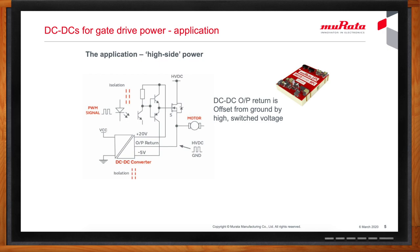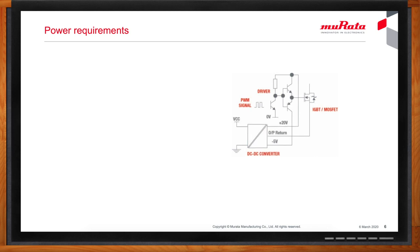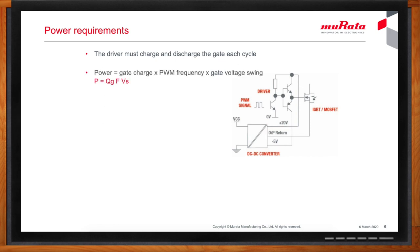Typical values seen are 380 volts DC from 240 volts AC mains, rectified and power factor corrected, or maybe 1,000 volts from rectified 690 volts AC, which is a common industrial voltage. To calculate power, a gate drive of a MOSFET or IGBT looks like a capacitor to the driving voltage. In a large IGBT device, the capacitance can be very high, measured in nanofarads. In each switching cycle, this capacitance is charged and discharged with pulses of current by the driver. Power equals gate charge times PWM frequency times gate voltage swing.